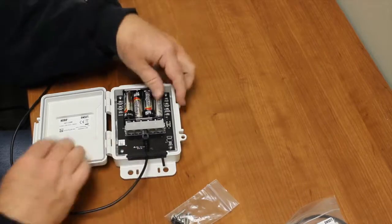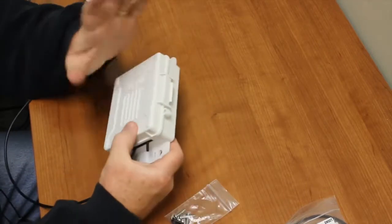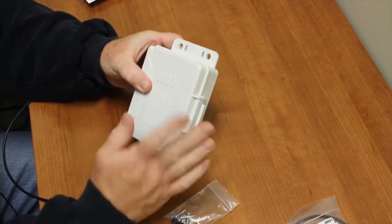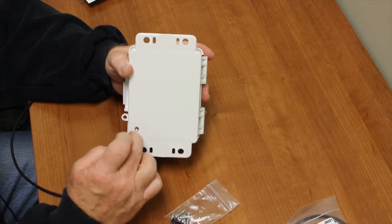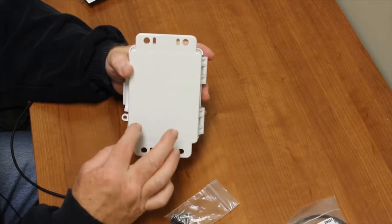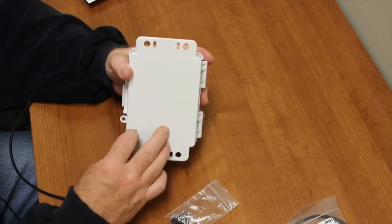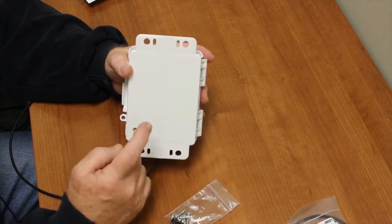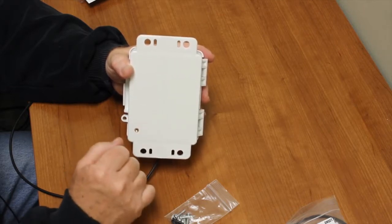The enclosure has a very nice positive latch on it. There is a lockable loop here so you can lock the door if you wish. In the back there's a pressed-in nut, and this is for the grounding kit. There will be the ability to ground the device to your tripod if you're using a wind speed sensor — it's recommended that you do that. Wind speed sensors are mechanical in nature and could build up an electrostatic charge, so it needs a place to discharge, which is why it's important to ground this device when using those kinds of sensors.